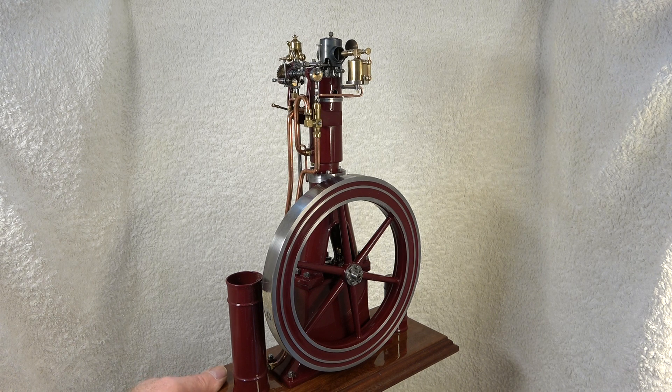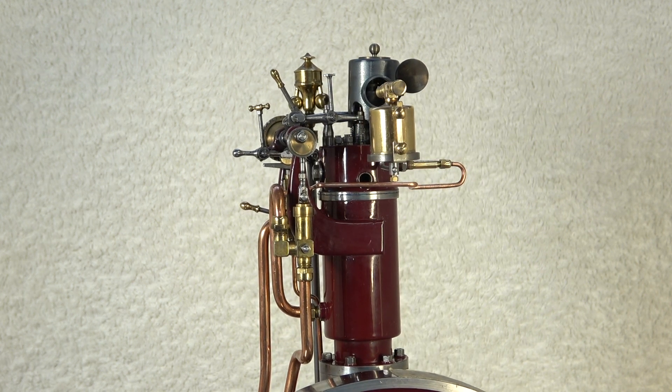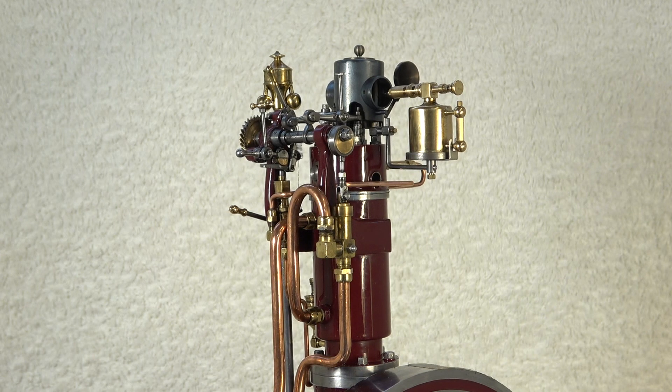I have all the parts for the engine to run it as a diesel engine like before. Why convert a true diesel engine to a semi-diesel? It's simply because I like to do experiments with my engines, and I found that the long stroked diesel engines, with a 40mm stroke and a rather heavy flywheel, would run very smooth, soft and slow. Another reason was that the compression ratio for the diesel engine is 20 to 1, and only 8 to 1 for the semi-diesel engine.